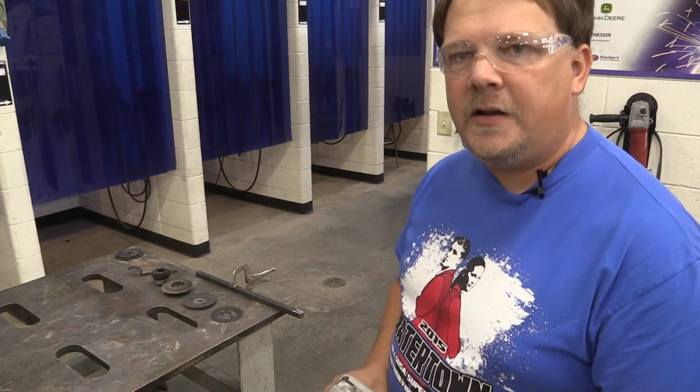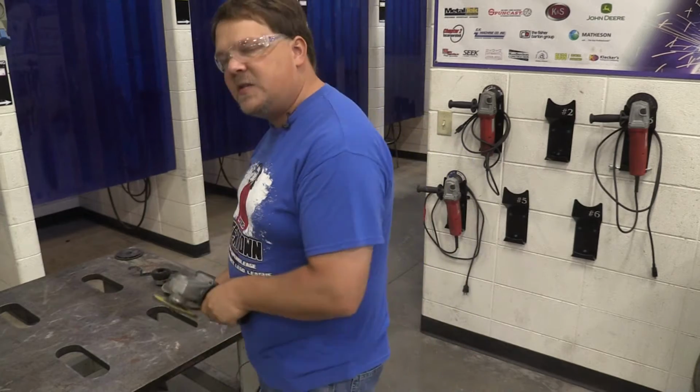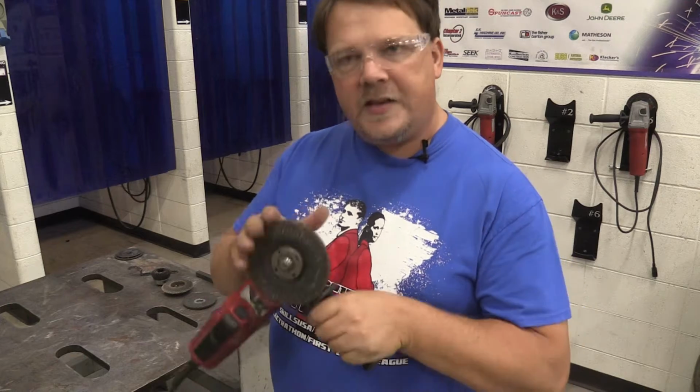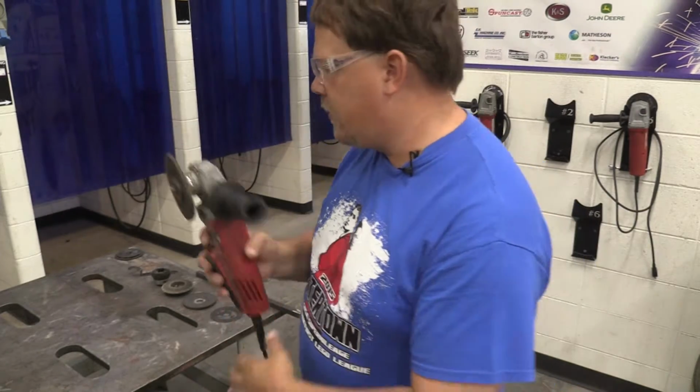And when we're done, we're just going to let it stop on its own. It is a common mistake for people, as it's spinning down, to run it on the table or on the material to slow it down, but that's not necessarily a safe thing for the grinders to do. You can probably do it a bunch of times, but in reality, this disc is meant to run at full RPM, so if you're putting pressure on it at lower RPMs, it's not always good for that disc. So let it stop under its own